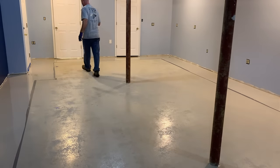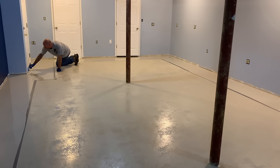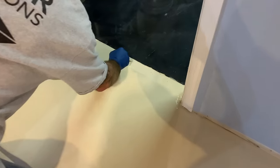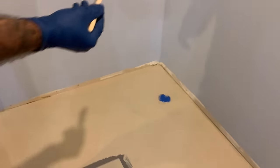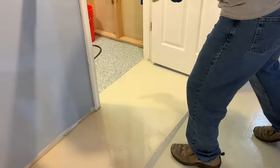Now that I have everything squeegeed out, I came around with my brush and I'm pushing some epoxy into areas I can't get to with the rollers — just around the door frames. Now I'm doing the detail work. I have somebody to hold the camera and follow me around. I'm going to use the 6-inch roller and get the rest, including the drain in the corner. I did run short, so I'm going to have to mix a little bit more. In the prep work I used a saw and cut straight across here — only about an eighth of an inch deep — and freehanding this, I just have to get flakes to stick here and that transition should be pretty close.